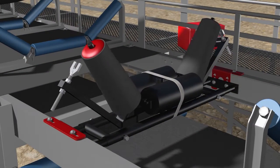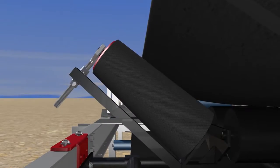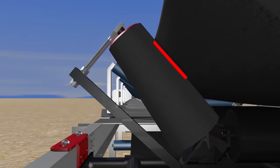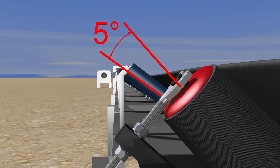Reinstall the taper wing rollers onto the cradle and then lower the belt onto the taper trough tracker. Adjust one of the taper wing rollers upwards until maximum belt contact on the taper wing roller is achieved with minimal tension, as over-tensioning of the taper wing roller will result in excessive wear on the rubber lagging. This is normally 5 degrees more than the existing troughing angle.